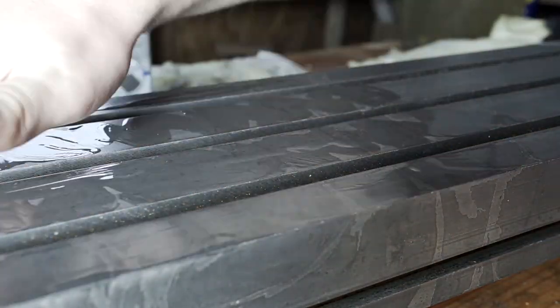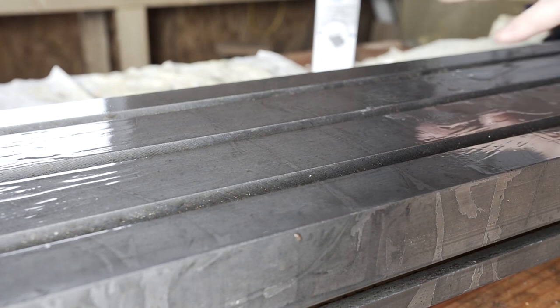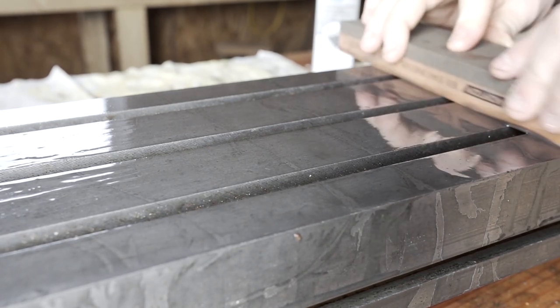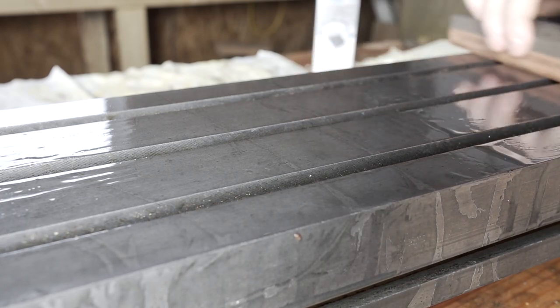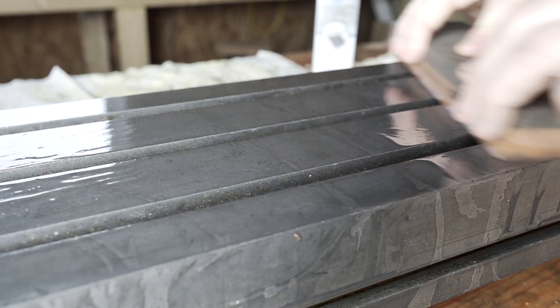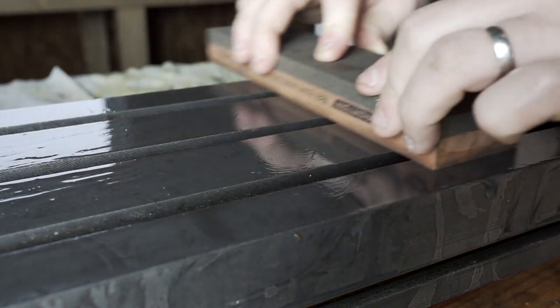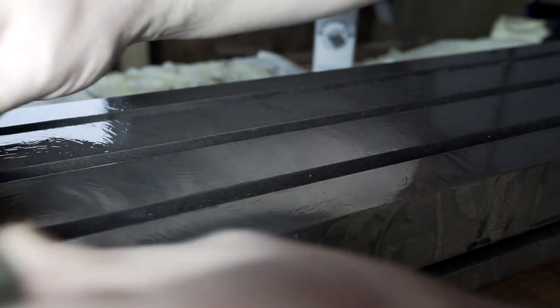The last thing to do was to give the table a quick stoning. I've never really stoned a precision surface before — outside of sharpening chisels I've never stoned anything — so I was pretty nervous about destroying the surface. I was relatively cautious and just did really light strokes, lingering on obvious burrs but otherwise keeping it to a minimum.